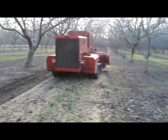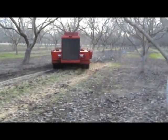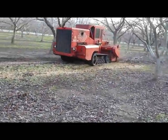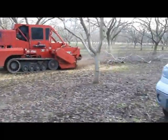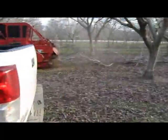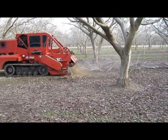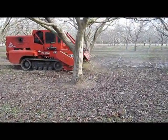You can see the chips on the ground and how small they are. It's key to have these chips very small because walnuts are shook and they fall on the ground, then they're swept up and hauled off to the processor. If the chips are too big, you get too much debris with the walnuts at the processor. When the chips are small, they fall through the machinery and never get picked up, making a cleaner product.